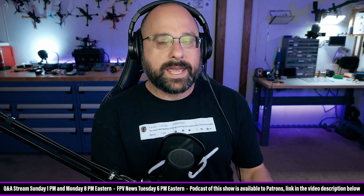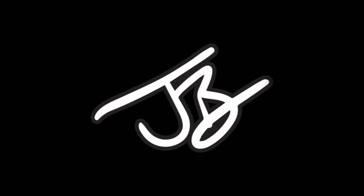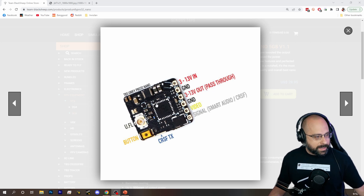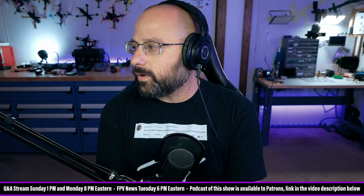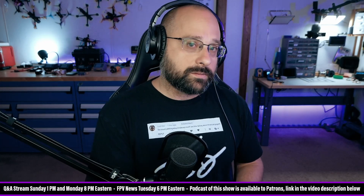Do you aim for the high end or the low end? So if you've got a component that can take between, let's say, three to twelve volts — that's weird. The reason I say that's weird is this device is probably running 3.3 volts internally. That's a common voltage for components like this. The typical way to build a 3.3 volt device would be to have a 3.3 volt step-down regulator that takes 4 to 12 volts in and steps it down to 3.3 volts. The fact that it can take 3 volts in — maybe the stuff internally is tolerant of as low as 3 volts, even though it's nominally running at 3.3 volts. Maybe it can go down to 2.9 volts.